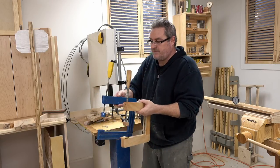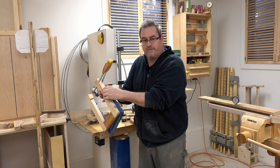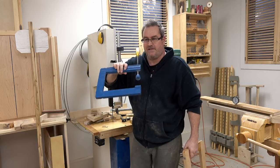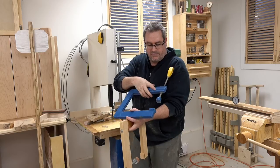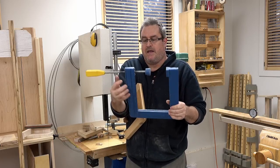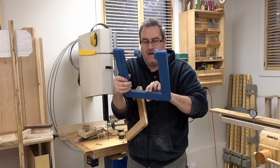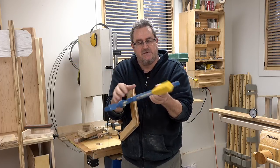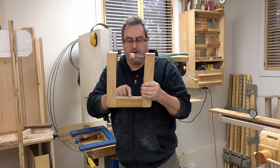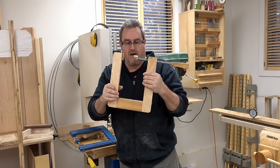Before I go, a quick comparison between these two clamps. First, I use thicker material for the arms and backbone of the clamp. This one is made with flooring that's three-quarters of an inch thick — actually a little less — and it also has those grooves cut in, which further weakens it. The lead screw is three-eighths of an inch and wants to bend further down, which is not good. The threaded rod in the spine on this one is quarter-inch, which is strong enough. But in the other clamp, I used a three-eighths inch threaded rod for the spine and a half-inch threaded rod for the lead screw, and that doesn't bend at all — a really strong combination.